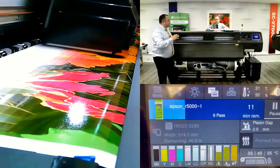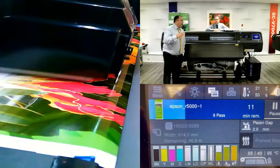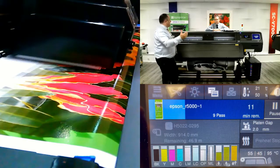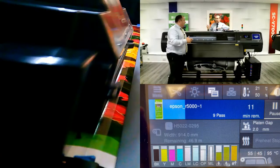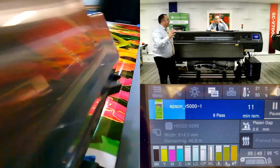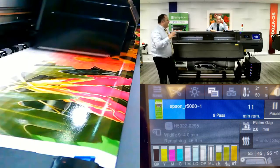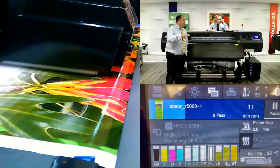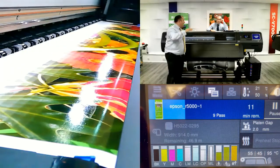It's so far in advance of what a lot of the signage printers out there using solvent ink sets are using. Some of the best solvent printers on the market would be around 7-8 picoliters. But again, it's a bigger, uglier droplet. And you have to remember what these droplets are used for. They are used for, as you whiz past on the road, it's in a sign.